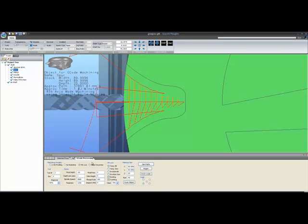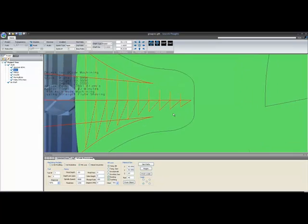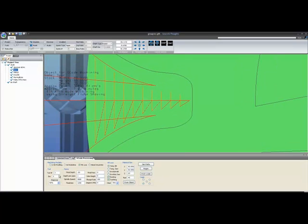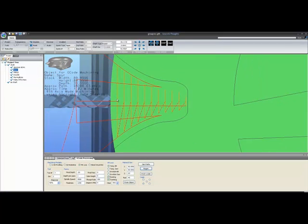And this is why it's important that you verify your toolpaths by at least looking at them judiciously to see if you're actually getting what you expect. And if that tool is going to do the job. You can see when I take it down to a 2mm tool in this case, I get even more of a tool path and more of a clearing, and I begin to see the shape of that trochoidal root reflected in the shape of this bit.